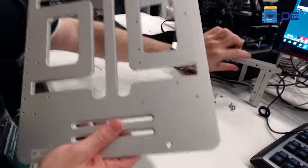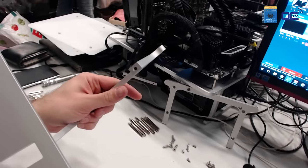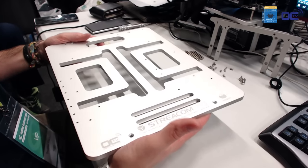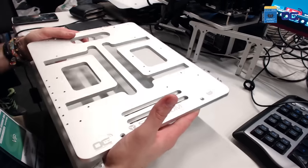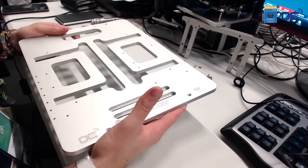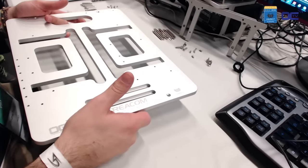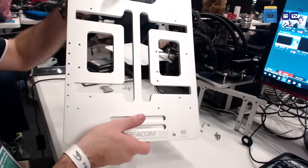It is about 2.2 kilos, 2.5 kilos if you include the whole packaging and everything — still fairly heavy. That's something we're still discussing: whether to make it thinner and how it's going to be stable enough with the legs. The difficulty is to be able to drill holes that are going to be solid enough to maintain the table properly without any issues of wearing off after a long period of time. But this table can actually take the load of a system like an ATX motherboard with all DIMM slots populated, four graphics cards, four GPU pots, everything under LN2 — it can take about 25 to 30 kilos. No problem.